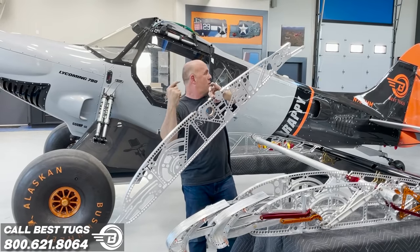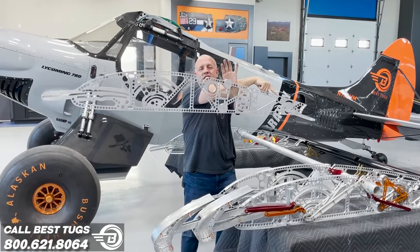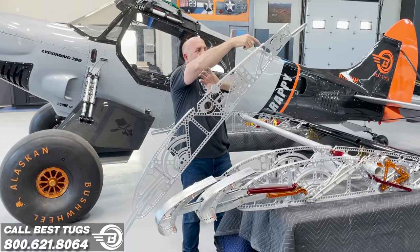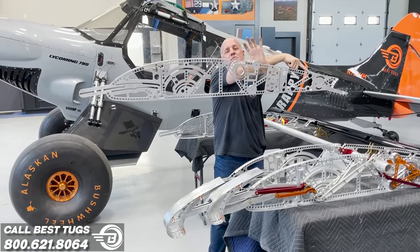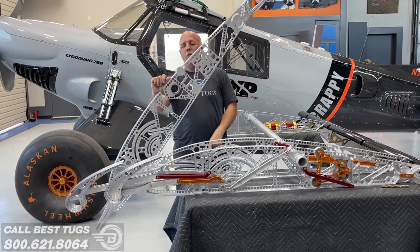So what do we do? Way at the back of the plane, we add an induced load by pulling back on the stick to keep the nose of the aircraft up. But the weight that I'm holding on my thumb at this position actually has just gone up by the weight it takes to counter the pitching moment. But the flap added more lift than the elevator took away.